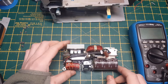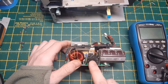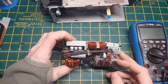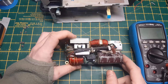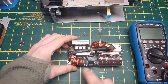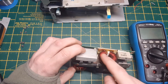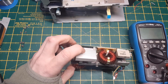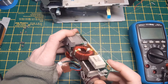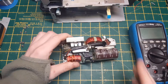Let's have a little scout around the board. There's a nice little film cap, there's an NTC inrush current limiter. That looks like a diode — it's labeled but I can't see it. This power supply is very tightly packed — majorly so. But as you can tell there's adequate filtering — big common mode chokes and all sorts. It's got another sensor on it as well. Another big common mode choke over here, and that looks like a 1 microfarad 400 volt capacitor on the input. The bridge rectifier is down here.